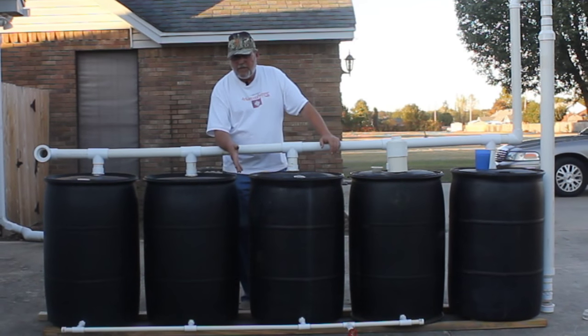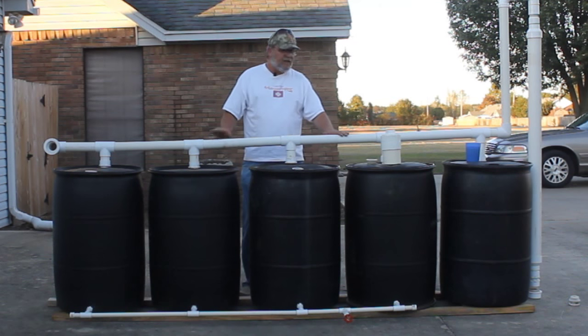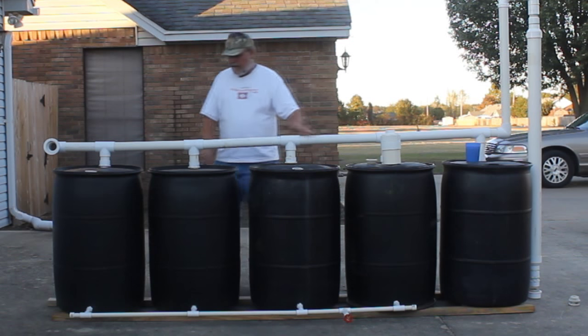By that time you'll probably want to replace it anyway because that pipe will get to where it may just fracture and break someday. But this stuff up here is going to last a long time as long as you keep it out of the sun. If you're in an area where you can't keep it out of the sun, cover it — do something to keep the sun's rays from hitting this top portion.